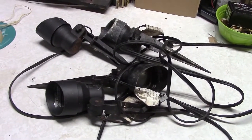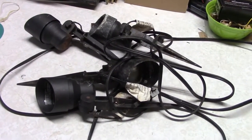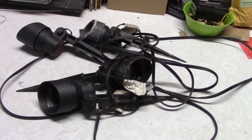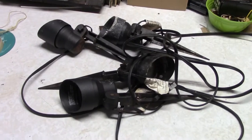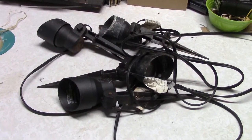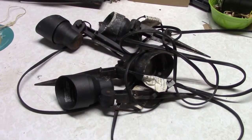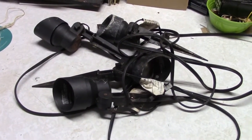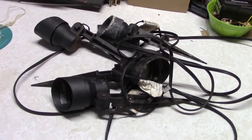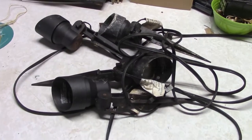It took a lot of maintenance to keep these incandescent lights running. And as a side benefit, I would hope to get lower cost of operation because I planned on using LEDs. I found that my LED design only uses about 4 watts of power compared to 120 watts for incandescent bulbs, and that comes down to about $0.25 a month for LEDs versus about $7 a month for incandescents, running them about 14 hours a day.